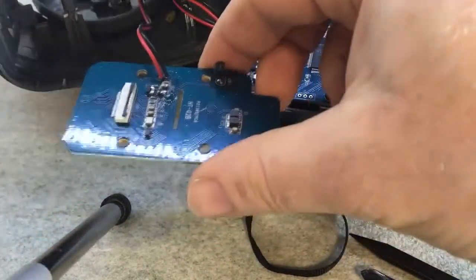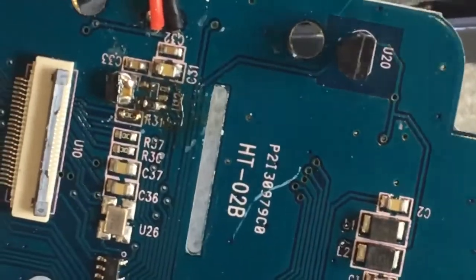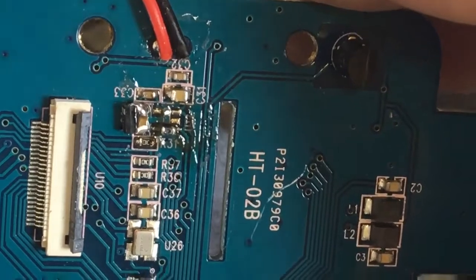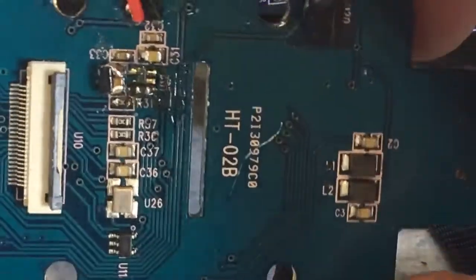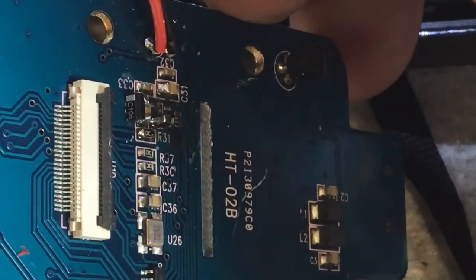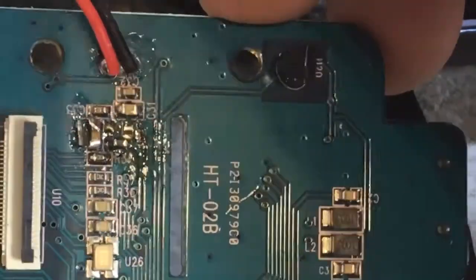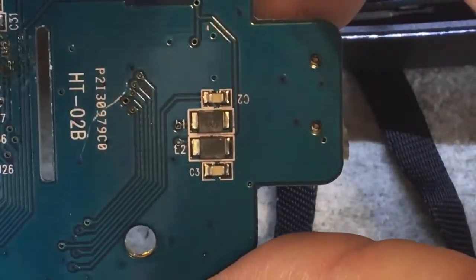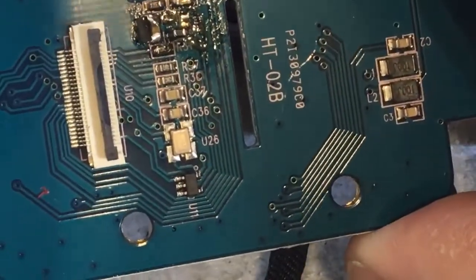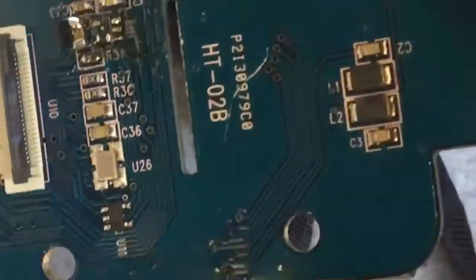So this is where things get a bit more obvious. I've taken the optical assembly off — this is the back of the board. What do you see there? What looks wrong with this picture? Lots of bodges. Lots of flux left on the board. There's a diode in parallel — it could be a capacitor — but it's in parallel there, and there's a lot of flux and crap on the board. This part here looks kind of dodgy. Really, really dodgy.